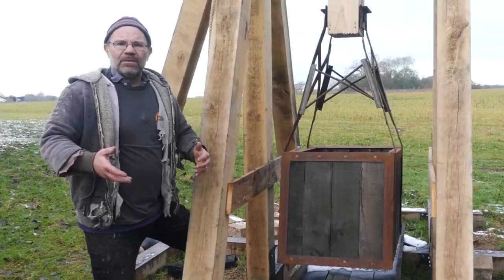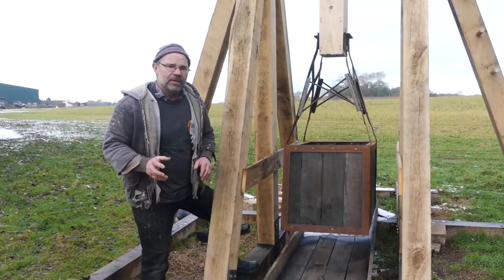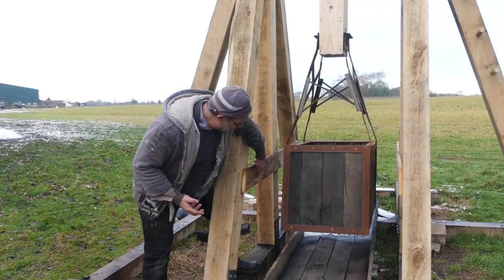So when we actually damaged it, what happened was the bucket came down swinging and jerking around violently, and it actually ended up hitting the edge of this support here. Not that violently, fortunately, but it did rip a chunk off. So then when I came back here, I put these guide rails on, but again, I hadn't straightened the bucket. And so the first shot, this bucket came in and scraped the side of this, and it immediately told me I had to sort the problem out.